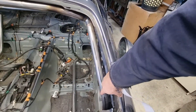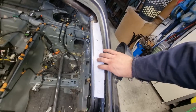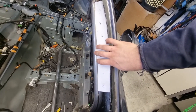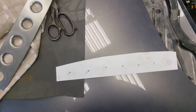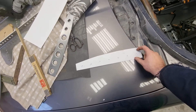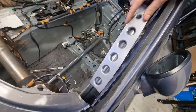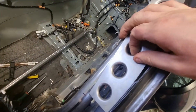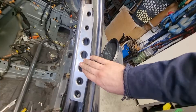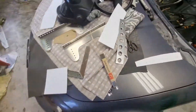Up the front here we're looking at getting some bracing plates in - it looks good as well as adding strength, and ties the A pillar to the cage. I'll cut a cardboard template, work out where I want everything and what diameter holes I can fit. I've gone through and marked these at 50mm hole centres - something consistent depending on your hole diameter. This is one I've just finished making. I'll show you how I dimple these in a couple of seconds. Yeah, that fits up in there - it finishes the look of the car and adds quite a bit of strength.